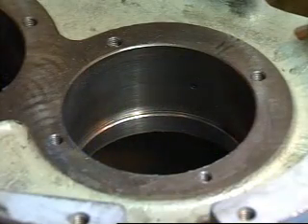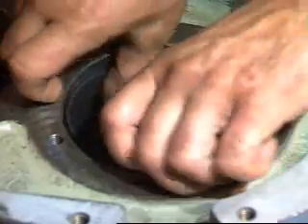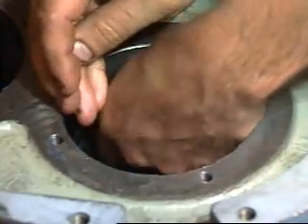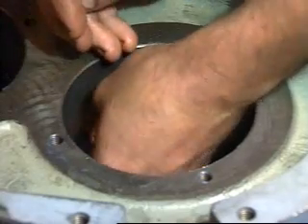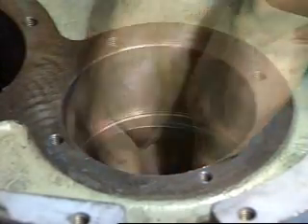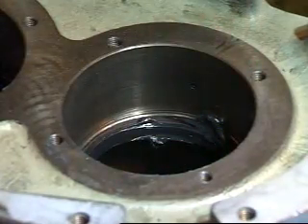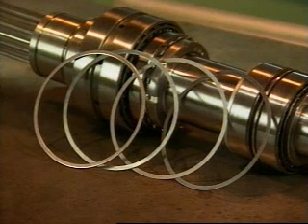Place the bearing housing on an arbor press. For pumps without bearing spacers, install the front bearing grease seals with the lip toward the center of the cavity, flush with the back face of the bore. Coat the lip seals with microplate grease number 555. The next step involves shimming, which is a most critical step, and if done properly, will assure the correct front face and back face clearances for trouble-free operation.